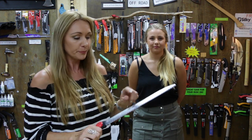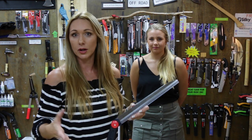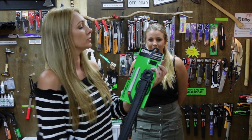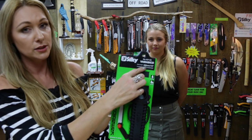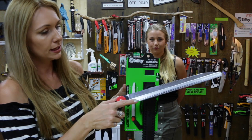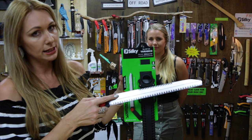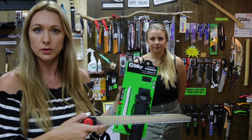The other reason why this is so super fast is not just the really big teeth, but also the style of tooth. If you're in a shop or looking at a catalog, Silky make the packaging really, really informative. You'll see here that this says it's a 33 centimeter long blade - so really long - and then it says 7 plus 10 teeth. That means the bottom teeth are 7 teeth per 30 millimeters and the top teeth are 10 teeth per 30 millimeters. That's how you can compare tooth size across different saws.